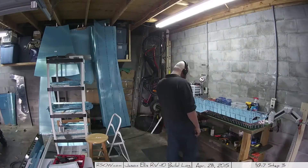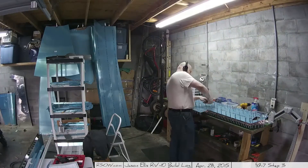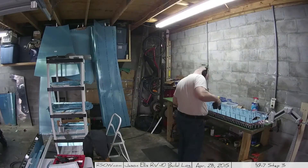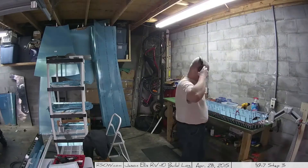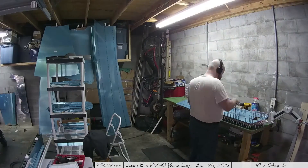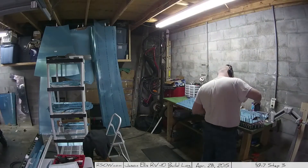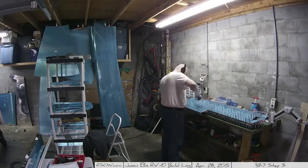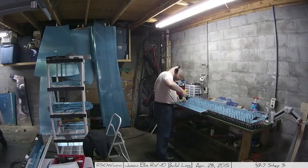I think I've done a good job with that, but I would definitely recommend being proactive when it comes to marking all the parts left or right — where they live on the plane and on the individual piece — because many parts just look identical, especially after you get them match drilled. Once you drill a reinforcement plate for the right elevator, that's where it should always go. You could easily flip it backwards, slide it to the wrong position, or put it on the other elevator entirely. Just be careful and mark the heck out of stuff so you know exactly where it lives.